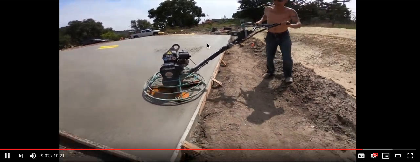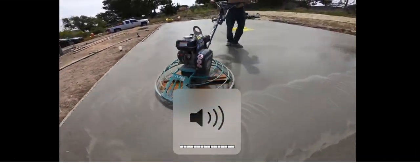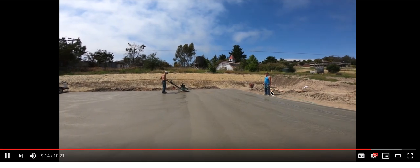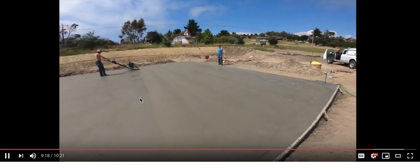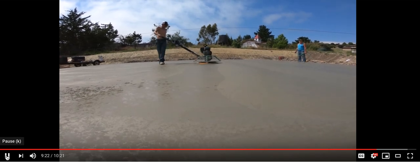Here we go — now look at this. What the heck is going on here? This is the guy's foot, so he's not sinking in. He's got the pads kicked way out and he's bringing up cream. We got a man on the water hose — water hose — and the machine going nuts on it. Getting a nice clean finish, he thinks. You're pulling up that cream again with that hose. It's no longer curing, but you're causing issues. This is going to have all types of cracks in it — shrinkage cracks.